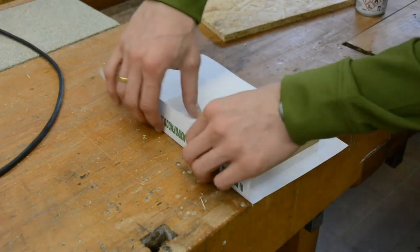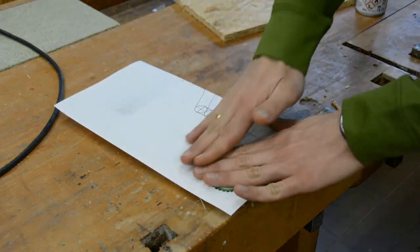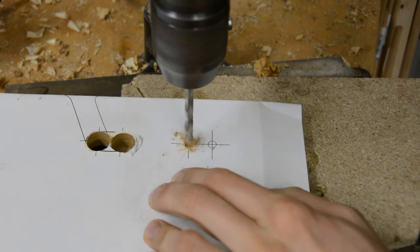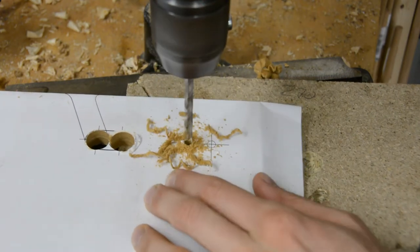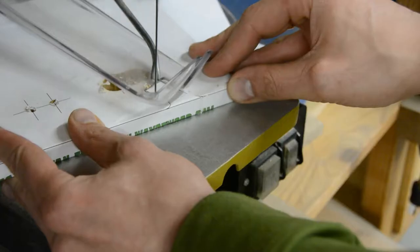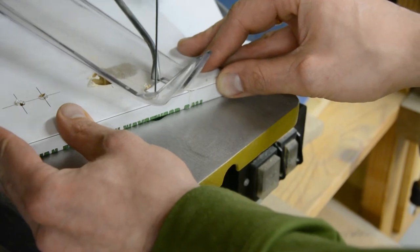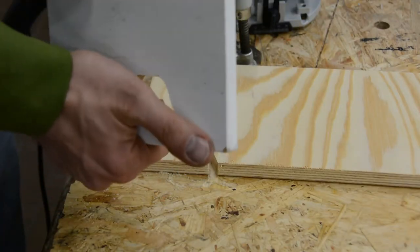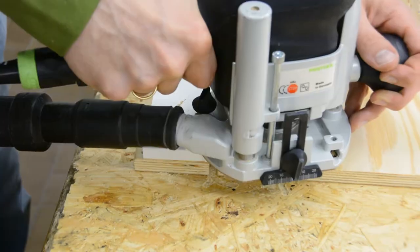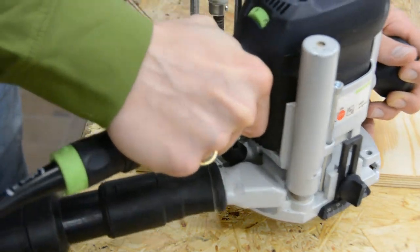If you don't have a CNC, I'll link in the description to a free plan on my website that also contains this template. Use a drill that corresponds to your slot size to drill the smaller holes, and drill larger holes equal to the size of the guide bushing of your router. Connect the large holes with a jigsaw or coping saw and sand them smooth. By putting dowels in the smaller holes you can register them against the previous slot and rout the next slot by riding the bushing of your router against the wall of the larger slot.